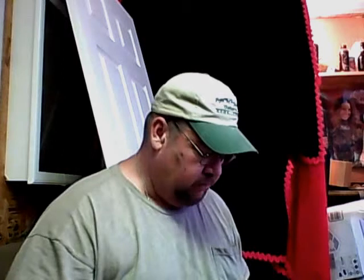Now, if you ever tried to use this cold blue, you know you rub it on cold steel and it don't look like you've done anything. It takes about 20 coats and then you walk off and leave it, and the next day you can tell a little bit of bluing on it. I learned by trial and error that if you'll heat that metal up, it activates that blue. And it does a much nicer job.